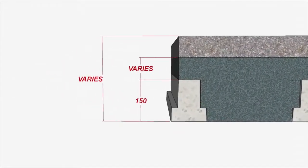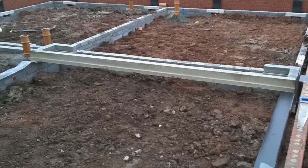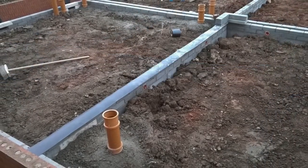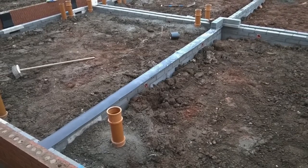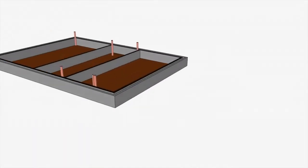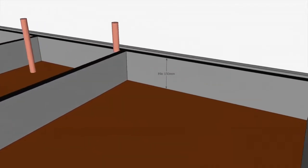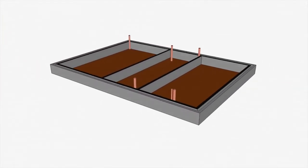Check the overall construction thickness of the floor to calculate the correct bearing level. The site must be prepared correctly for installation. Bearings must be level, cured, and fit to receive the precast concrete units. The ground must be free from vegetable matter and set to a level at least 150 millimeters below the lowest point of the floor to maintain the required ventilation.